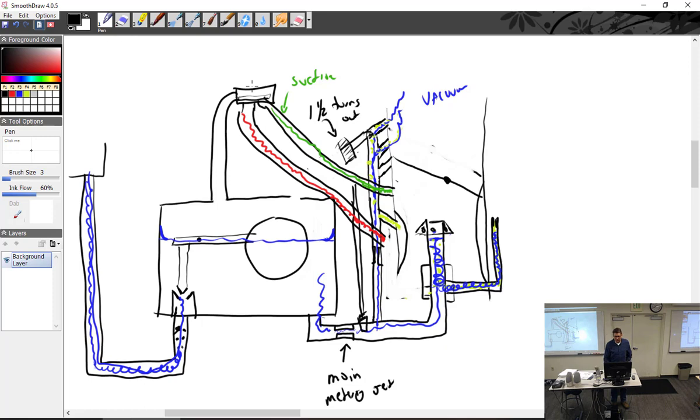All right. So number one, suction. If this is at idle right now, which it is with the throttle valve, how much suction is right here between the throttle valve and the discharge nozzle? None. It's pretty much, yeah, not much. It's extremely, no, almost no suction whatsoever. So how much suction do I have in this line right here? None. Pretty much nothing. So if I have no suction, do you think this is going to work? No. Okay, it doesn't work in idle because this tube is down here.